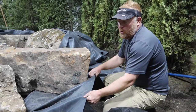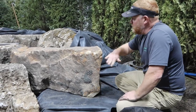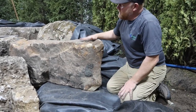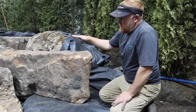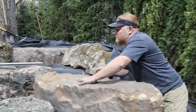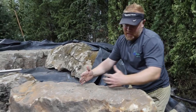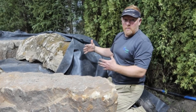What to do with the liner - we'll call it our vault liner, the main liner that goes down underneath the aqua blocks. It was supposed to come all the way up to the top but it was short and we had to do the bib liner. We put this wing wall rock in - this kind of frames out that big waterfall area over there. We're not using it at all to hold water back. This point was high here but because I need to bring in soil at least this high in here, this actually becomes a wing wall plus it's retaining soil back behind it.